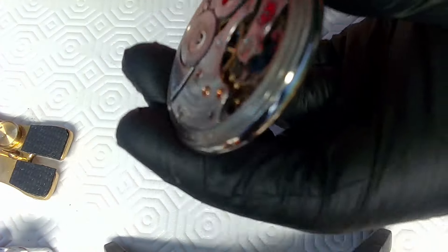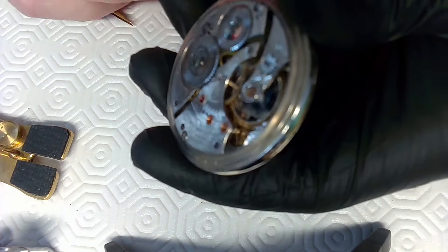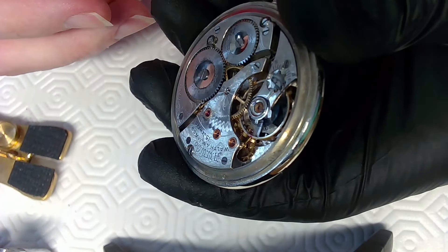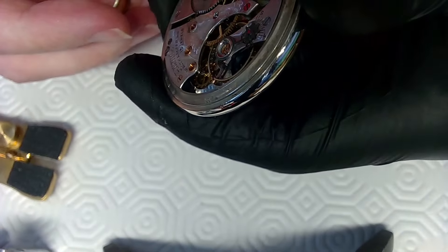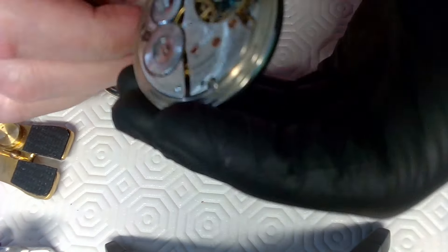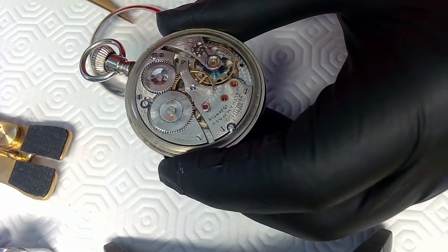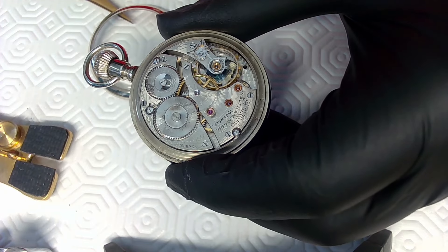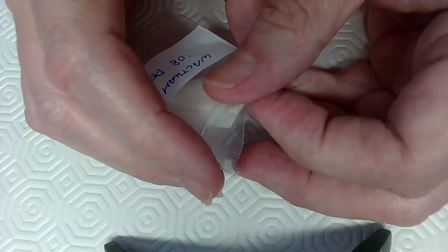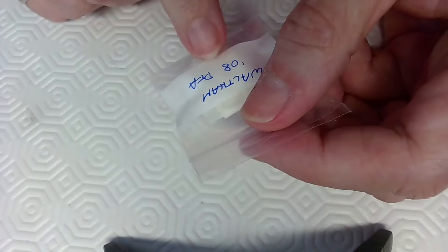So there we go — I'm JD. I did the change and we'll see how well this takes. If there's an issue later on and I know how to solve it, it's the pallet fork. This one doesn't want to seem to hold its amplitude, and maybe the pallet fork needs adjustment — hopefully not, because it kind of got stuck on the roller table. We'll just let it work itself in. That's it — welcome to my channel again, please subscribe, please hit like. If you want me to do work on your watch, please let me know. Seems to be running okay now. I'm going to put the old part back in the bag in case I need to use the old shellacked pallet fork at some future time.